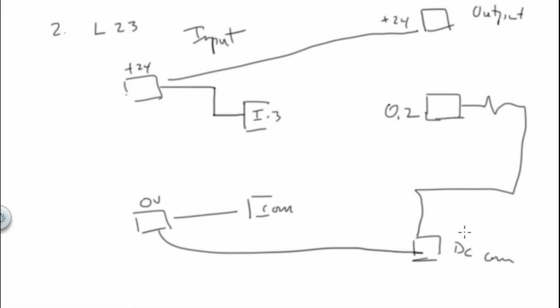So also in this chapter we talked about the original Modicon 084, and the point of the original Modicon 084 was what? The first input could either be normally open or normally closed, and then all succeeding inputs could either be normally open or normally closed, but if they were ORed, they had to go all the way back to the bus at the left.